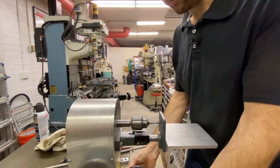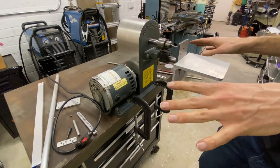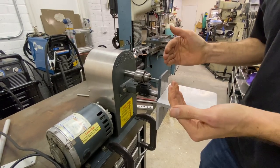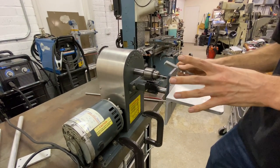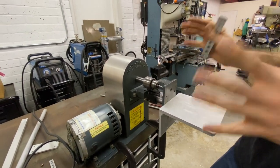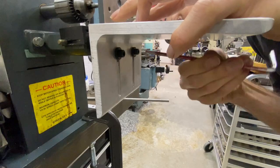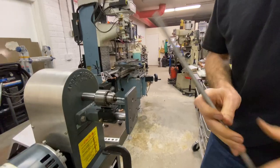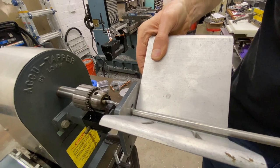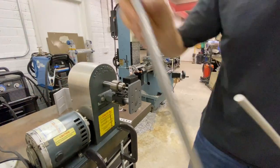This one is very compact and bench mountable — it's currently on a big cast iron top table. You really want it mounted to the floor or to a table that's heavy enough so it won't move when you push on it. It takes a decent amount of force to activate the torque, and the torque is based on how much force you apply. It takes up to a 3/8-16 tap, though I'm not sure I'd want to do that all the time — you'd need it very rigidly mounted. It comes with a little adjustable, removable table with multiple mounting positions that slides on slots. You could also remove the table to use this for tapping the end of a rod, possibly in a V-fixture. This could be handy if you don't have a lathe or don't have one that takes stock big enough.